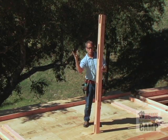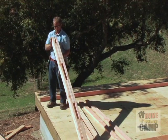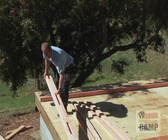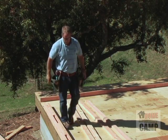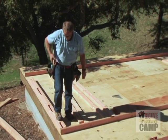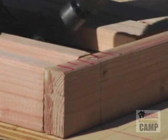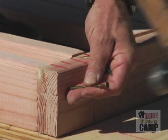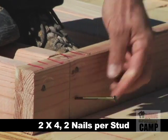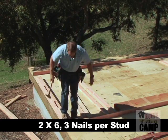This is why we work hard to make sure that this piece is nice and square, smooth and solid - it's for the end of your wall, it's where your next wall is going to go up against. So we'll spring this over here and make sure that it is crowned, even if it is crowned ever so small. Now we can go ahead and start building because we have no partitions or anything to worry about. Just make sure that this is nice and flush on the end. On two-by-fours you do two nails per stud, on a two-by-six it's three nails per stud, two-by-eight is four nails per stud, and so on.